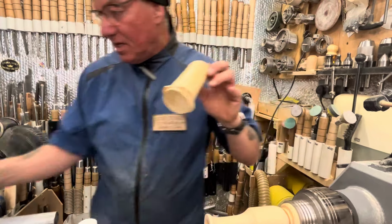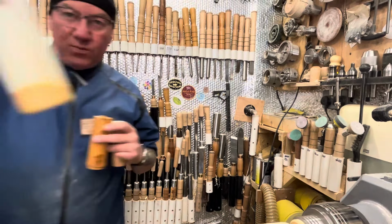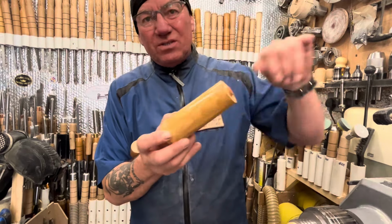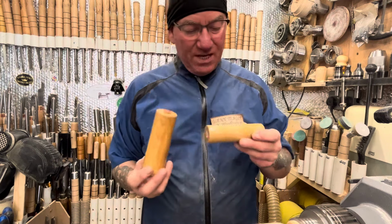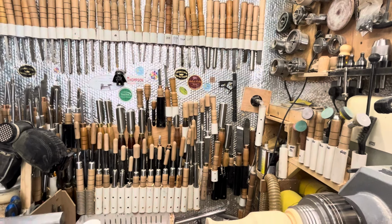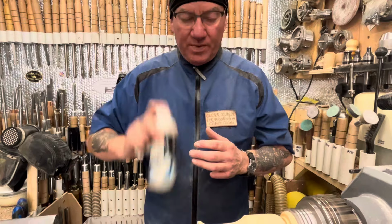So you get that finish. Now, if you have the thicker mix, the thick mix that I showed you, this one, if you want a really shiny finish, it's that. But to me, it looks and feels like plastic. Yes, really shiny, stays well, but to me, it looks like it's got a plastic coating over it. I really don't like it. The more shellac, the thicker you mix it, the thicker the shine's going to be, okay?